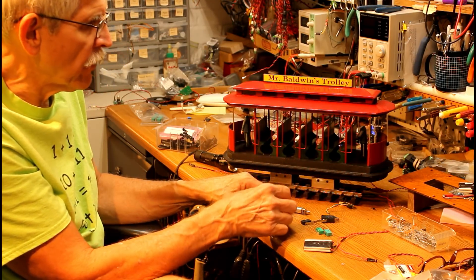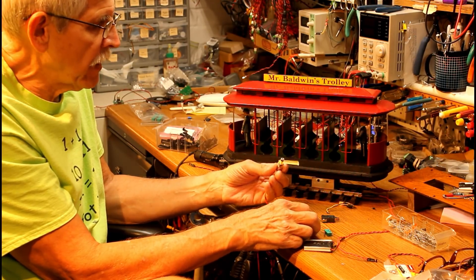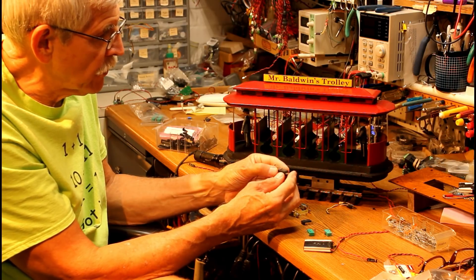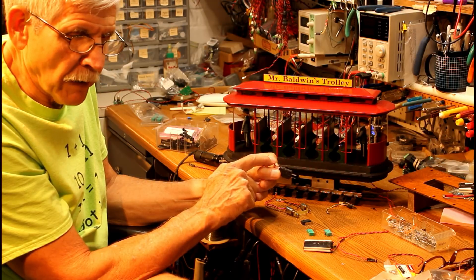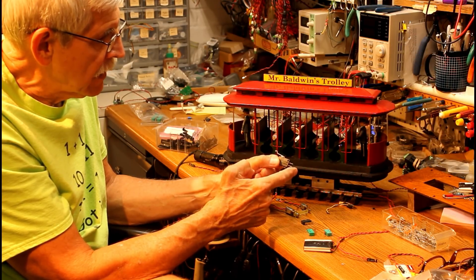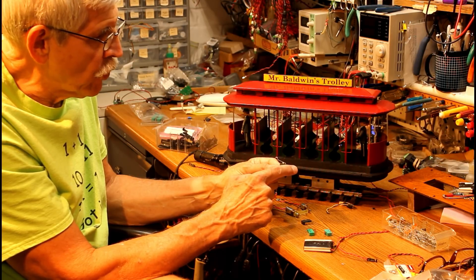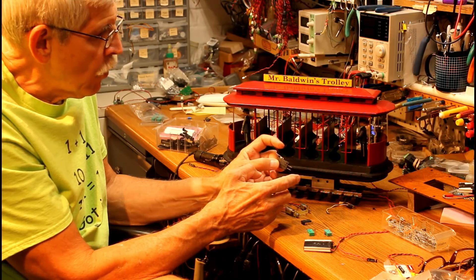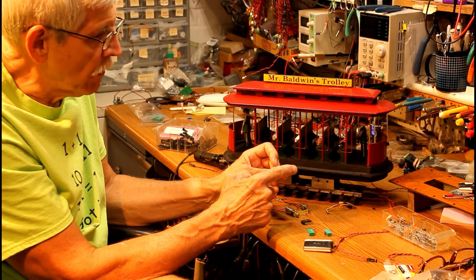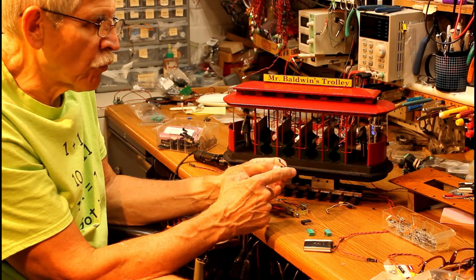So you've got a motor that can be put underneath. I had to add an arm to it — that's what you see sticking out here — because you need something that's going to hit the switch. I had to choose micro switches to act as limit switches. This is a fairly large one, but it's got the characteristics of most micro switches. It's got an arm and you can probably hear it clicking on and off. It has three contacts: a common, a normally open, and a normally closed contact. The normally closed contact allows power to travel from the common through when the switch is open. When you close the switch, the normally open contact conducts electricity and the normally closed is disconnected. What we're interested in is the normally closed contact, which allows the motor to run until the arm gets hit.